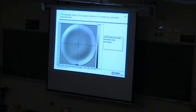The other problem we had is that we'd get different measurements on different days, and we discovered that it was sensitive to barometric pressure. Just little changes in the barometric pressure changed the index of refraction between the lenses by just enough that we would actually get a little variation in the focus of it. And so we had to build optical systems that were completely sealed with flat interfaces on the end, and were all made out of Invar so that they didn't thermally expand. We had to go to enormous lengths.